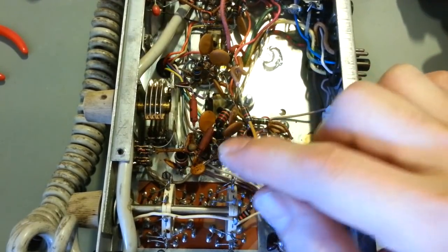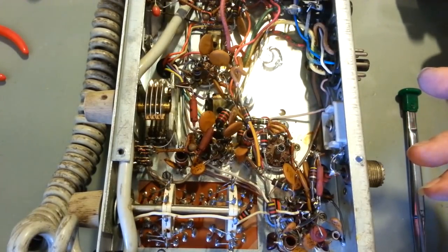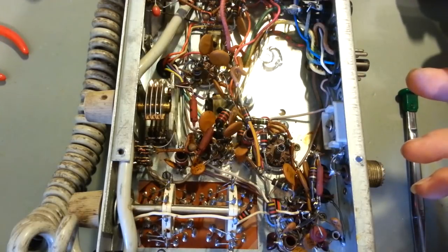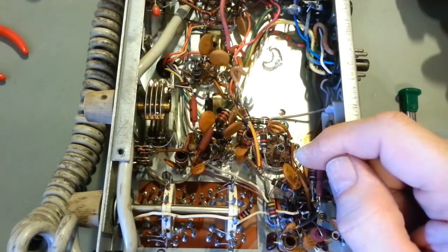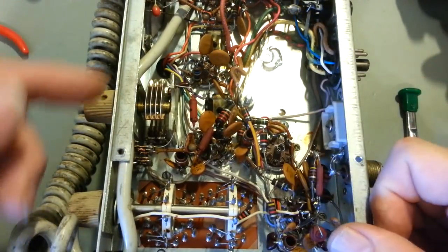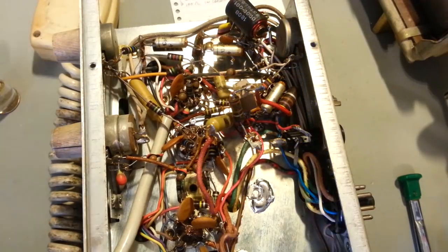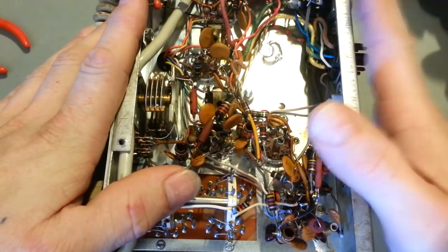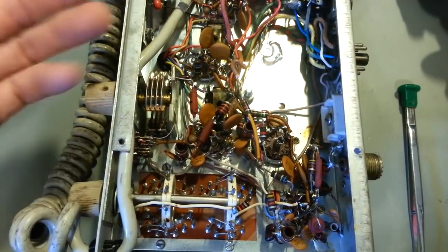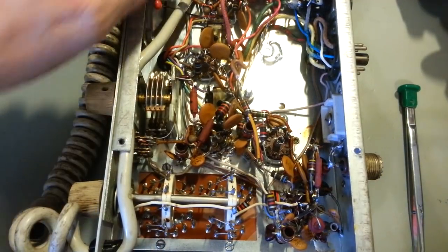The old tantalum capacitors actually weren't that reliable. I don't want to say they weren't reliable, but they were in their day. But this is an old radio. Like I say, this is 60s vintage. So I definitely want to get those things out of there. They just use those because they're smaller than the equivalent axial-leaded aluminum electrolytic capacitors. Now, sometimes you'll use a tantalum for a specific property that it has, but really in this radio, they're just using them because of size. I think I counted like 13 of them in this radio, so that's 13 aluminum electrolytics that didn't need to be in this.